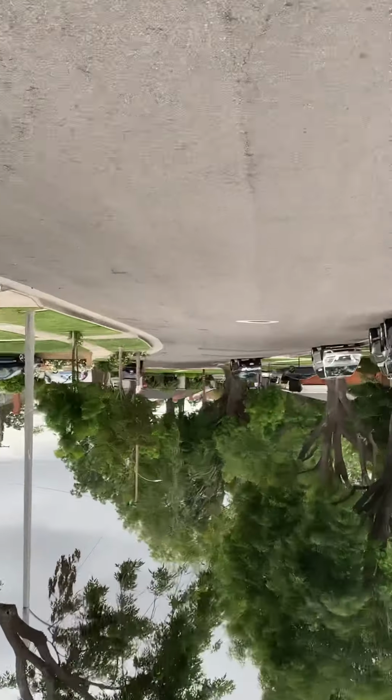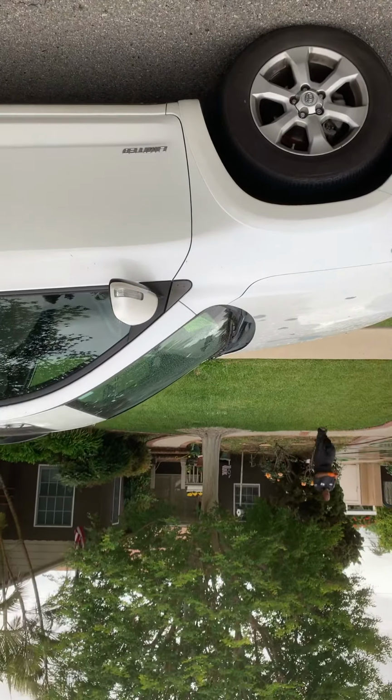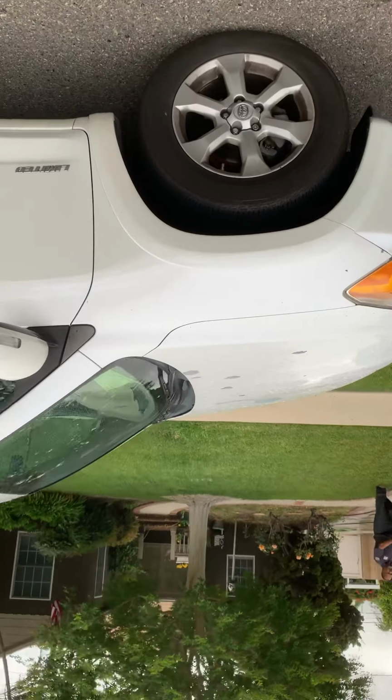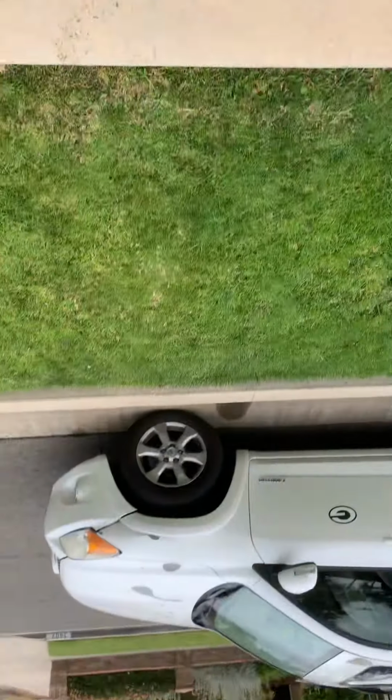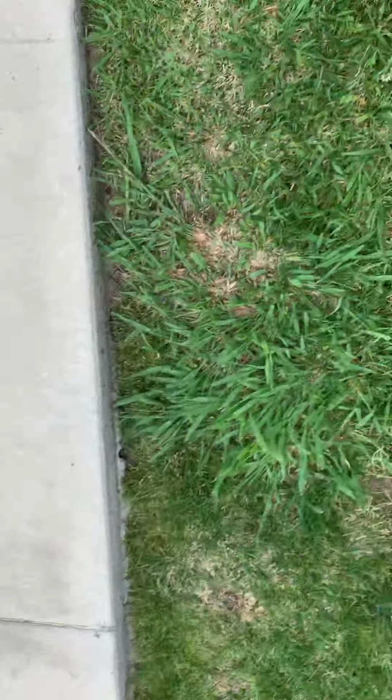There's your manhole down there. There's your manhole right there. This is the city sewer connection, and this is where you're having the worst of your problems. That's where those 2 offsets are. But then you just got roots growing all the way down this line, all the way to the house. So if we dug up a hole on this side of the sidewalk right here, we could take out a section of pipe and install a liner up to the house and install another liner out to the city sewer. And would leave you 2 caps right here in the grass for drain access in the future.